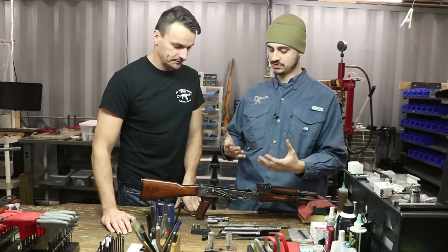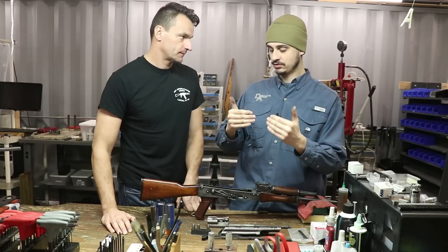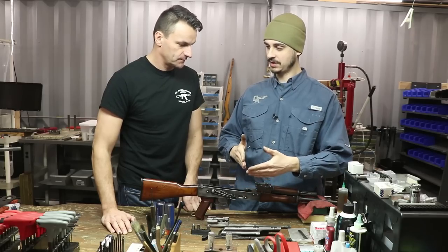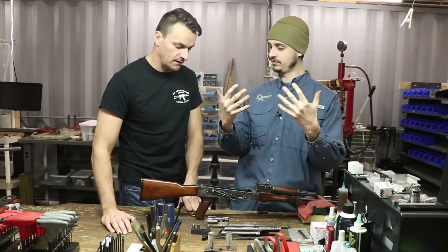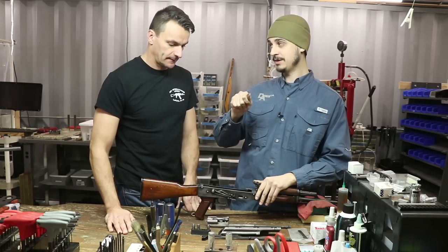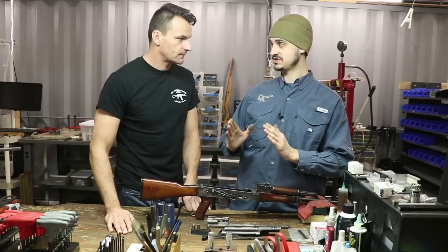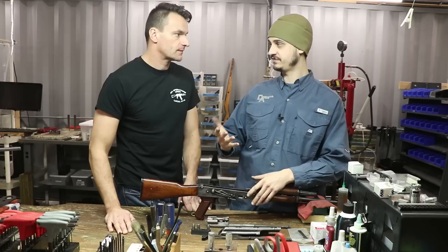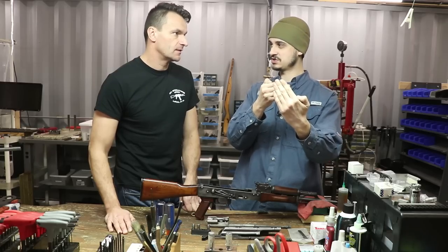They'd have to time bolt actions and military arms. At the factory, before anything had been fired and before handling high pressures, it had to pass a go and no-go gauge. The idea is some of these metals have pretty good toughness, but under their first bit of use they'll kind of forge into position — they'll move a little and stop. If you've got 10,000 rounds through the gun, it's worn in. Maybe it's barely reached that no-go gauge, but if it's still passing the field gauge, it's saying it's still safe to use. Keep checking it — the idea is it never ends up swallowing the field.